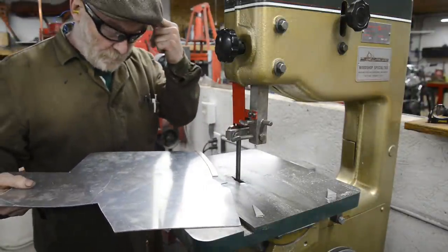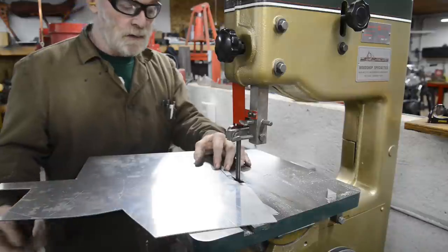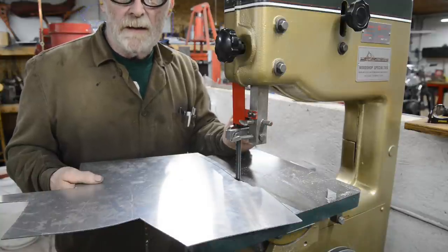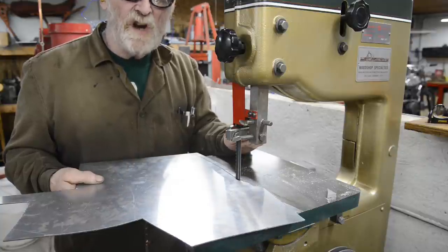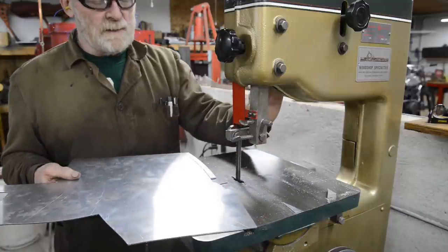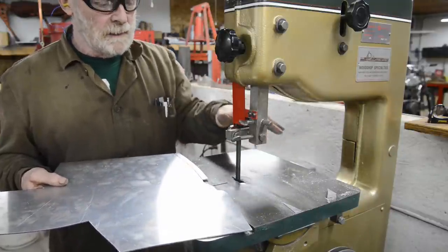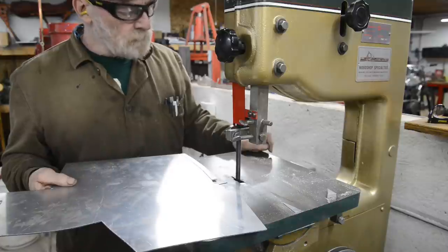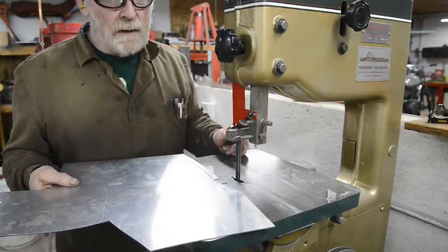Here's a little something about bandsaws. As I was looking for a metal cutting bandsaw, I saw in the catalogues, if you look at new ones, two bandsaws, identical spec, except one ran slower, and it was classed as a metal cutting one, and the other one ran faster, and it was a woodworking one. And the price difference was unbelievable. So one of my friends is a high-end woodworker, one of our group, and he refurbishes stuff. So I told him to keep an eye out for a nice, big, strong bandsaw, this is cast aluminium, the whole thing. And I've got a DC motor on it with a controller that regulates the torque and everything. And it's much cheaper. If any of you don't believe me, you go and look in a catalogue.